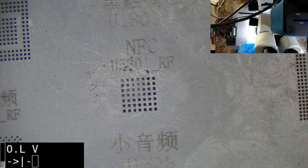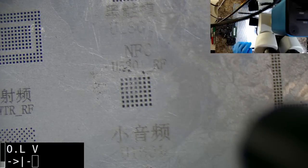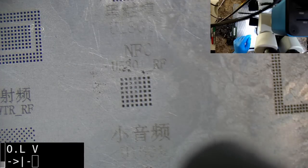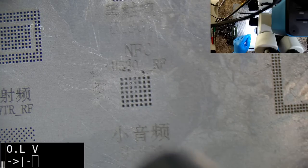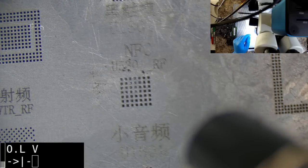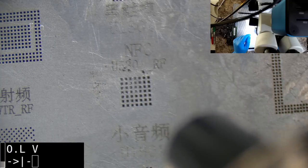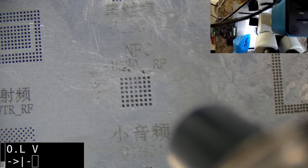And we now change over to a lower setting on the quick, and we just bake it. No active blowing. We just treat it like we've got it in the reflow oven, and let it do its thing. I'm just hoping the stencil doesn't pop. Usually it doesn't when I do it from a distance like this. It always seems to take a bit longer, but when you've only usually got to do it once, it overall takes less time.